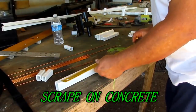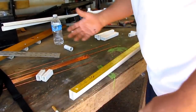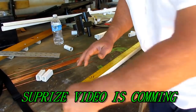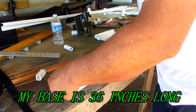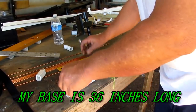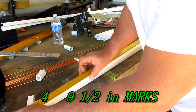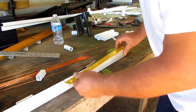I have some other videos I wanted to put on first, but I seen an old man copying my videos word for word. He ain't doing all the testing I've done. He's showing you like the old ultimate antenna — he ain't showing you the updates like what I'm fixing to show you. I'm going to put one of these pieces right here, and I'm going to make a mark right here. Then I'm going to put my ruler on here and come down and mark nine and a half inches, and then mark another nine and a half.